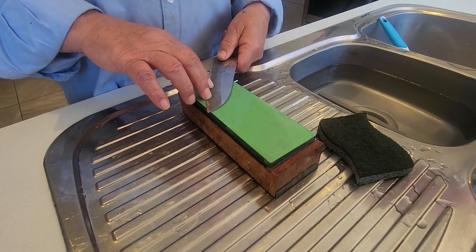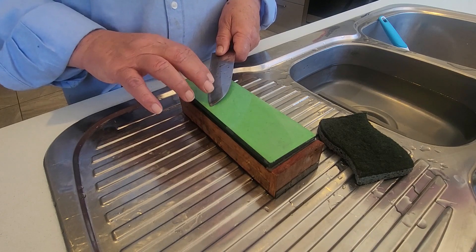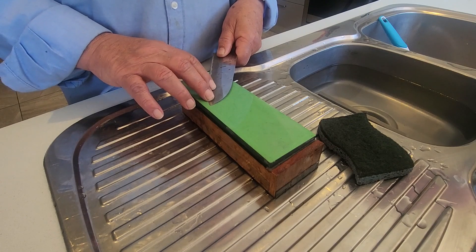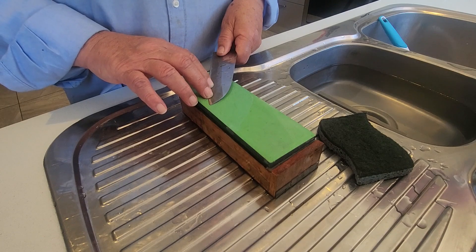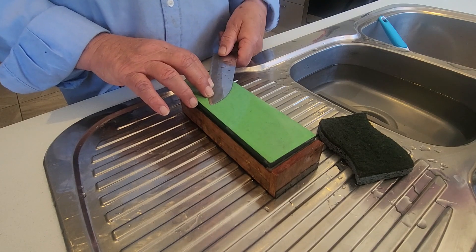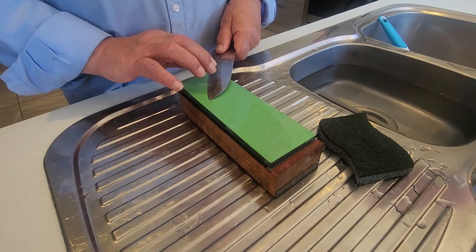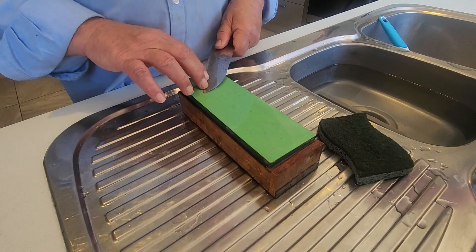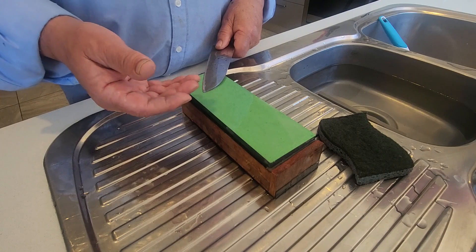The next thing is you should put your fingers as close to the bevel as you dare. It's not dangerous because you're moving away from the edge. I will point out that sometimes I have bandages on my fingers — these stones are quite coarse, and if you're sharpening 15 knives a day you'll actually wear some finger off, and it takes days to heal. We're slowly going to push forward, find that edge, put our fingers where we want to sharpen, and move along the blade. We push to the end, then lift the weight off slightly and draw it back — lifting so we don't dig the knife into the stone or change the angle and undo what we're doing.